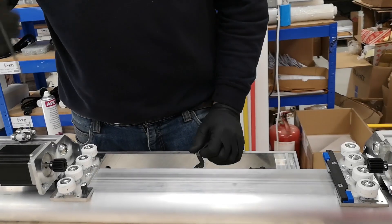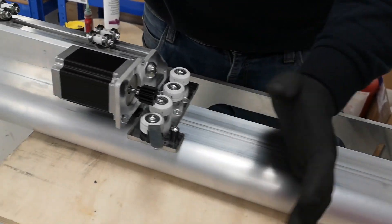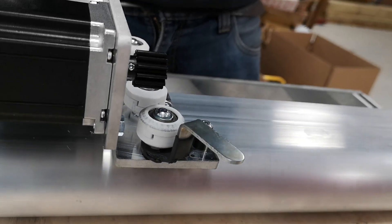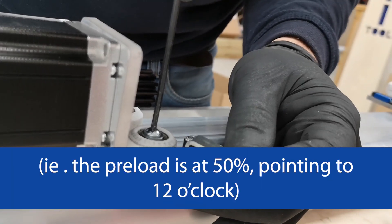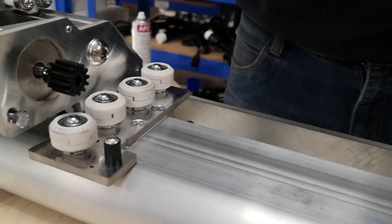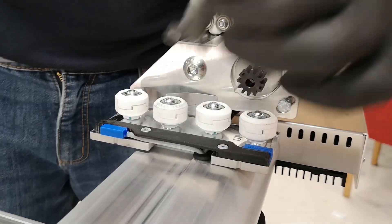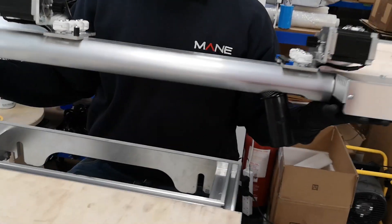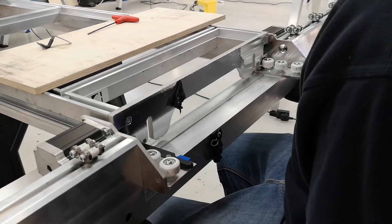Third step: we only want to start adjusting with the first and third wheel on both sides. We bring all the cams for the first and third wheel on both sides to the same orientation — I like to do it away from me — and then just nip them down. Now we try to set the preload on the first set of wheels. In my case, that looks okay.